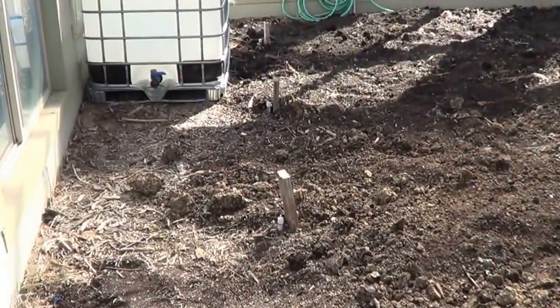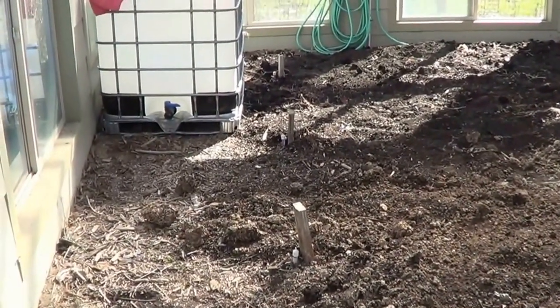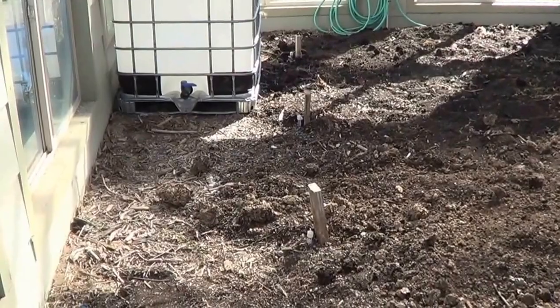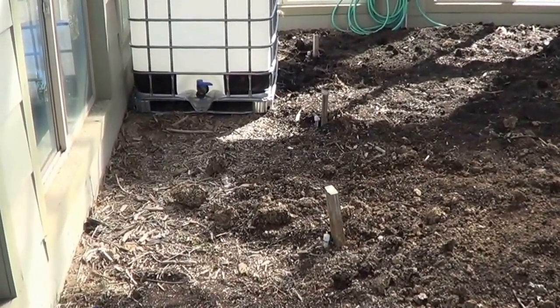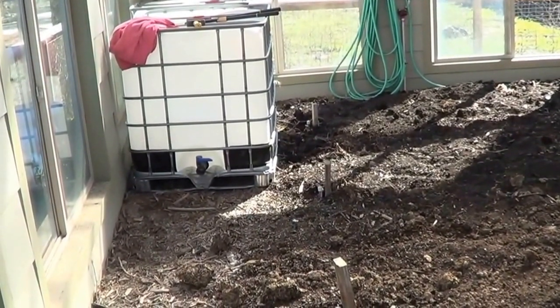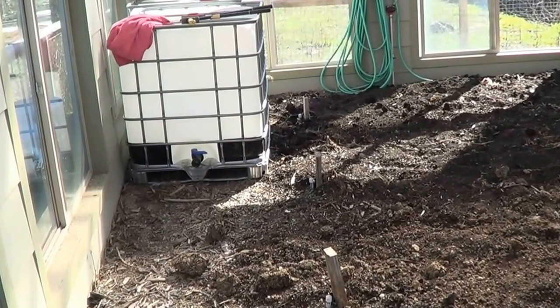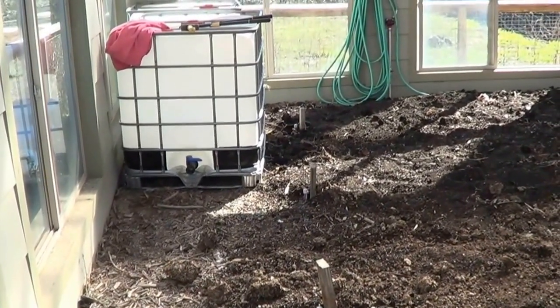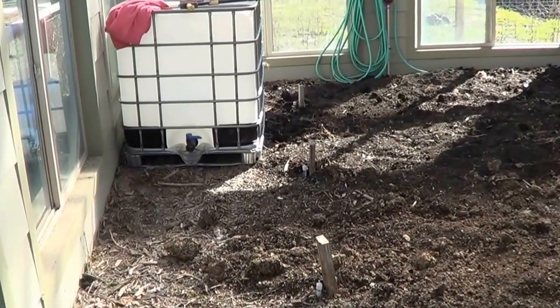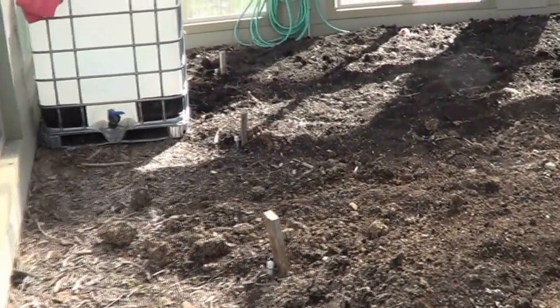So glad it's done! These two-by-fours sticking out of the ground are little spikes - you can see water spigots coming out, because each bed we had here had a water line with some drippers. The last one down there - I was like I'll cap them later after I get done, but then my big old size 12 kicked it and we had old faithful for a while. So yeah - cap them first, cut them down, cap them. That's a bit of advice!